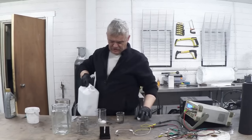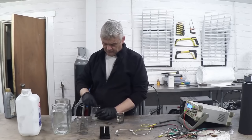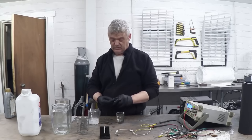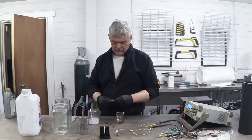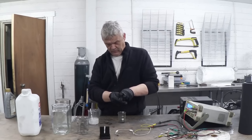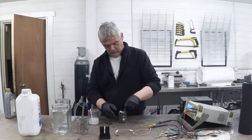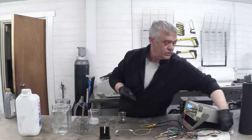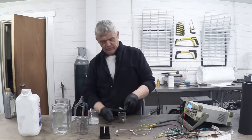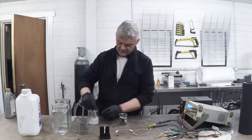I'm making this up to about 60 millilitres, just demonstrating. I've got a piece of zinc that I'll fold over and over — it will sit just under the solution surface like the last piece of zinc did. Then I'll top it off with a little motor oil. I did cover how to make zinc bromide if you can't buy it: there's a video on making it from sodium bromide and zinc sulphate, both of which are very easy to get. So there is my basic gravity cell — carbon and zinc — and here is the zinc bromide solution.